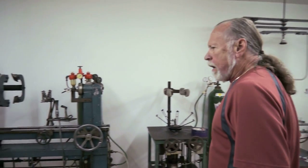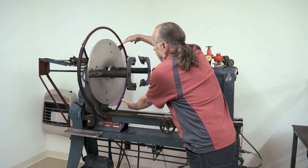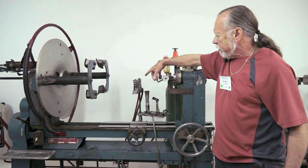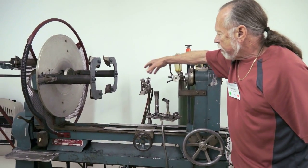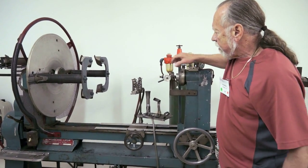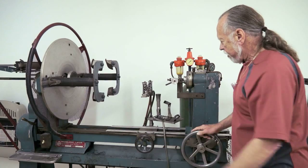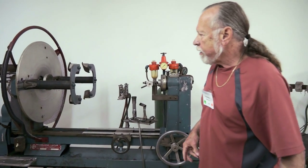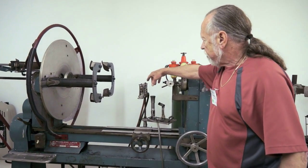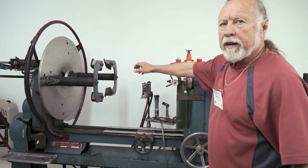This is a horizontal lathe. The tube mounts here with its neck sticking out this way, and it's used for welding glass tubing to the neck of the tube that's been cut off. You put the new glass on here, and then you can crank it and move it in place while you heat it with these gas jets, which are connected to oxygen and hydrogen, while the motor turns this thing around to keep the flames even on the thing.